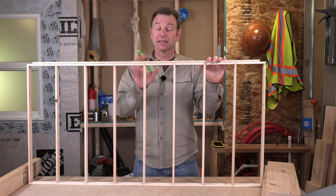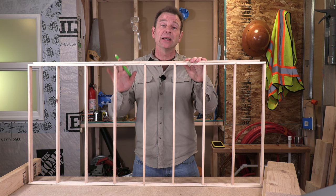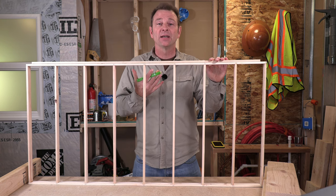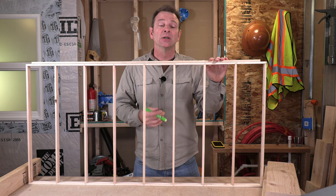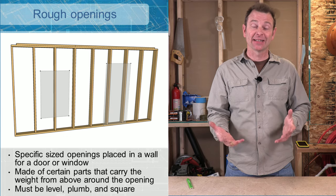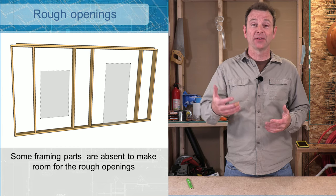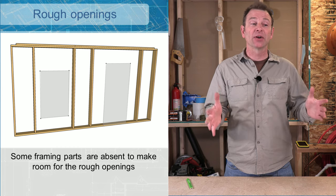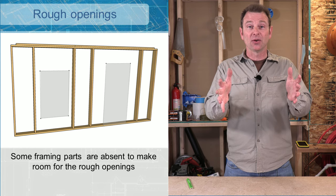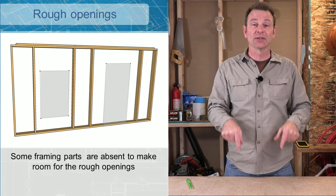This example of a wall panel is about as basic as it gets — you can see the patterns and all the parts. In real life it's very rare that you have a solid continuous wall with no openings. We like our openings whether that's for doors or windows, and it happens a lot in a building. This concept is that we're punching a hole in the wall. If we remove some common studs and add weight from above right now this wall would collapse — we have large spans that are unsupported. What our rough opening does is allows us to punch that hole but still carry weight from above down and around the opening to the bottom plate.